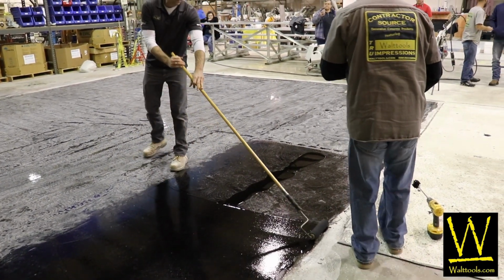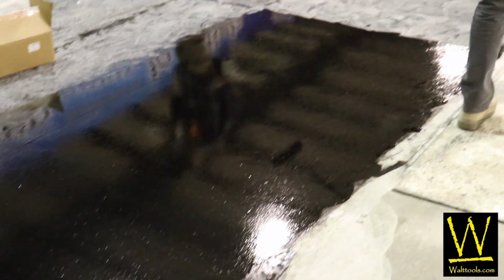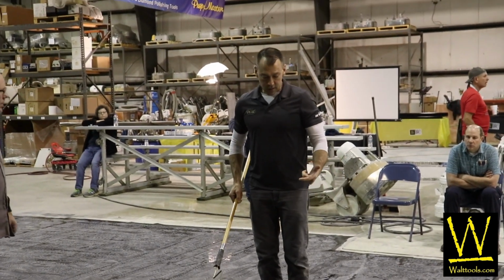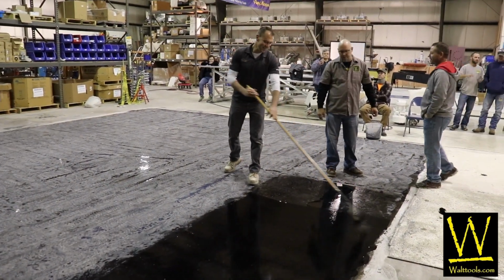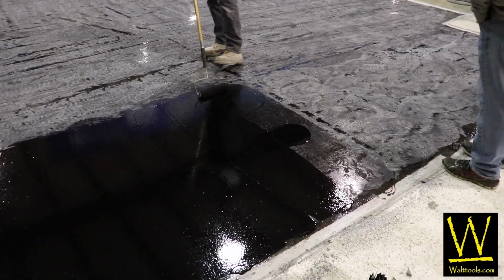No puddle. And again, it's always important to not have variation in thickness, but the reason it's so important here is because anywhere he throws the flake, if it hits and it's only so thick, if it hits that and then sinks underneath, or the quartz is going to help it to sink underneath, we're going to lose the flake altogether. You guys want to come see how thin this is? It's really like rolling out a coat of paint. It's like glue, really.